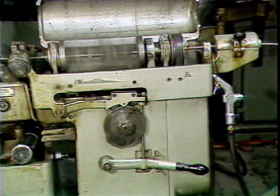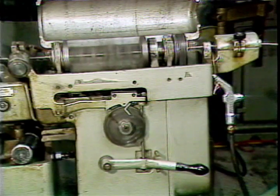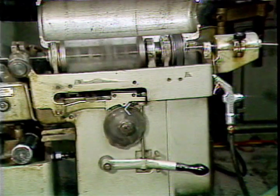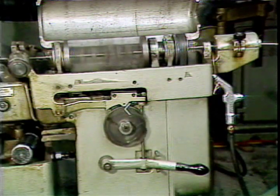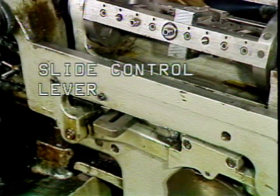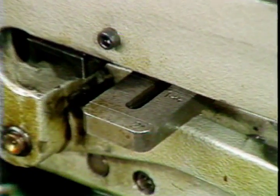The start of the backward travel of the straightener slide is timed to the high point of the overbend straightener jaw cam. The backward travel time of the straightener slide is matched to the feed lever return cam and clutch cam time. When a 65-degree return cam and clutch cam are used, the straightener slide cam and return cam must also be 65 degrees. This is the operator control side end of the slide control lever.